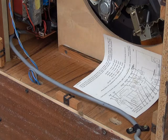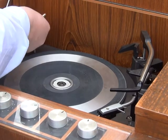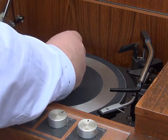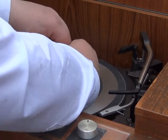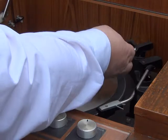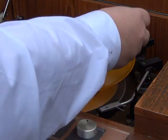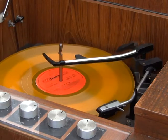So we're going to put it back on its bottom and run up the turntable. We'll take the manual spindle out, put it in its little place where it lives, and pop in the auto spindle. Now we're just going to make sure it auto-drops with the centre spindle fitted and see whether the stylus goes anywhere near the correct part of the edge of the record. If it doesn't, the adjuster for that is there. We've set it to 33 — it automatically detects the size of the record because of a little sensor. Let's see what happens.